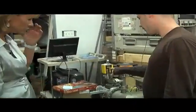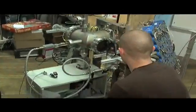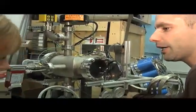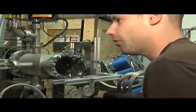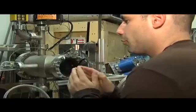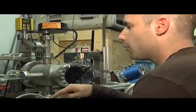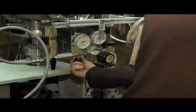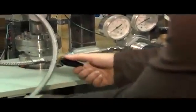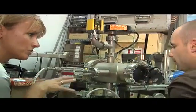So this is ready to go — that's a pretty deep vacuum right now. What I'm going to do is just open up the deuterium. Deuterium is the fuel that runs the reaction — it's an isotope of hydrogen. The reaction we're doing is smashing two deuterium atoms together and it produces one of two branches: either a neutron and helium-3, or a proton and tritium. So right now you're introducing deuterium into the chamber. Yep. Now we're ready to turn on the high voltage, so we're going to go to the back of the room and set up the camera so we can see what happens.